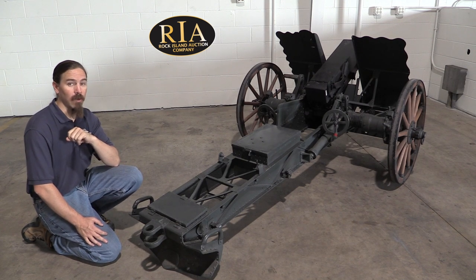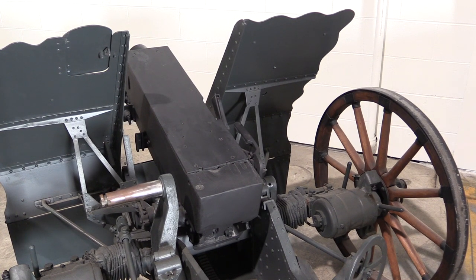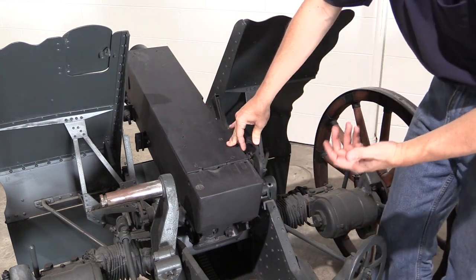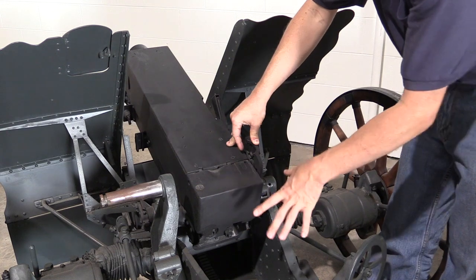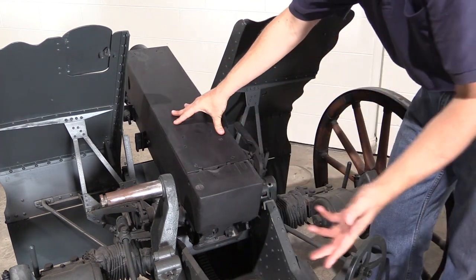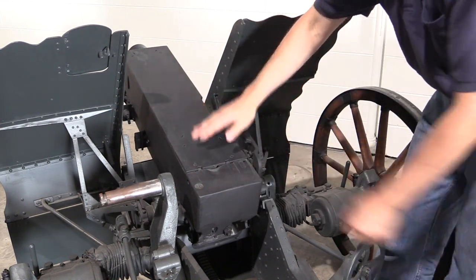Unfortunately this gun is welded shut, but it had a really unusual action and it looks strange. The action on this piece is really fairly unusual — it's this kind of weird boxy thing, and it actually functions rather like a break-action shotgun. The whole box is going to recoil backwards when it fires, which is pretty typical, just to absorb the energy of firing something like this. The reason for that is what you're trying to do is isolate the carriage — you want the carriage to stay in place so that you don't have to completely re-sight the gun with every shot. After this recoils back, the front side of the breech block actually pops up — think of it like a break-action shotgun — and spits the shell out.